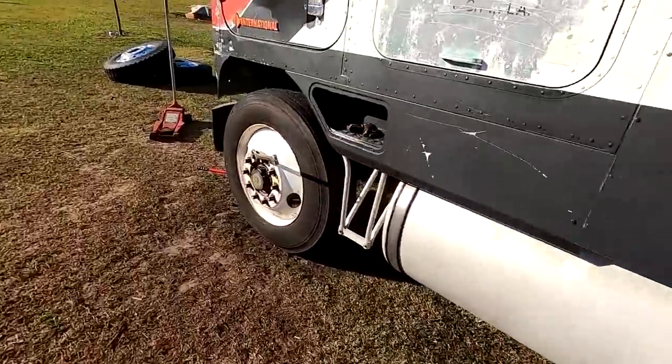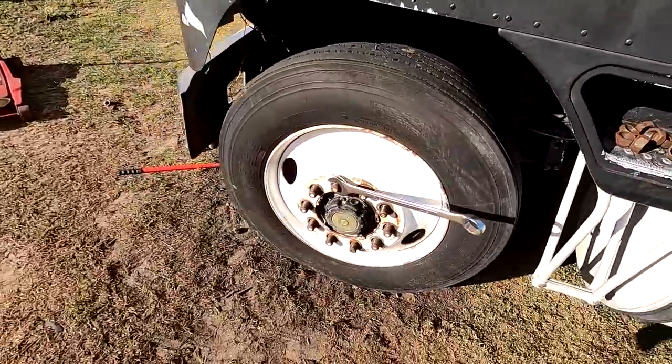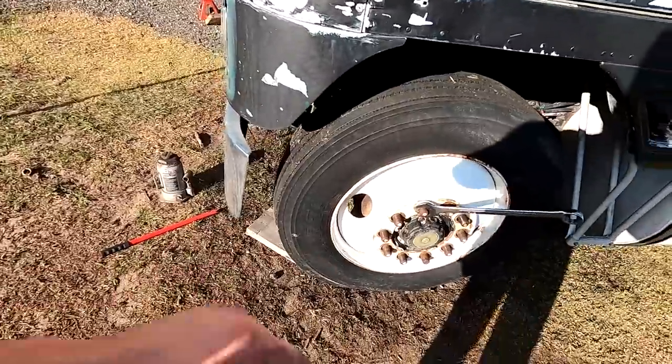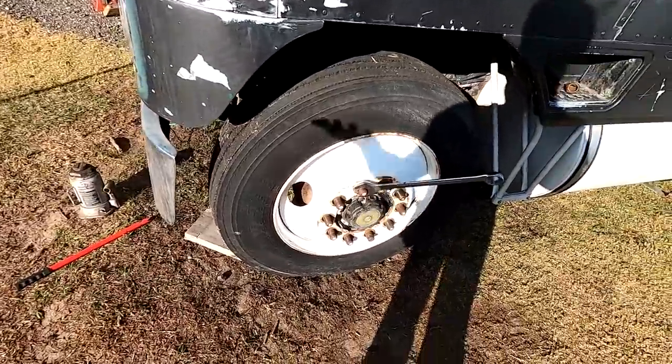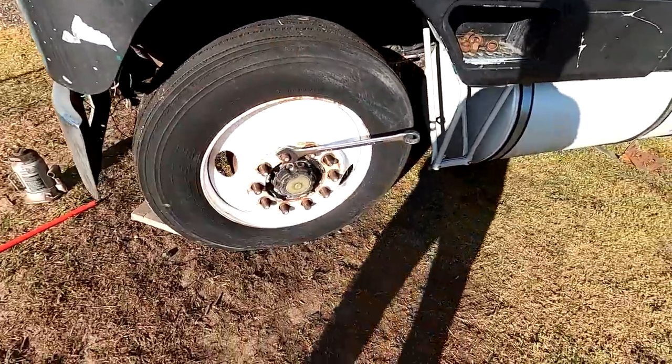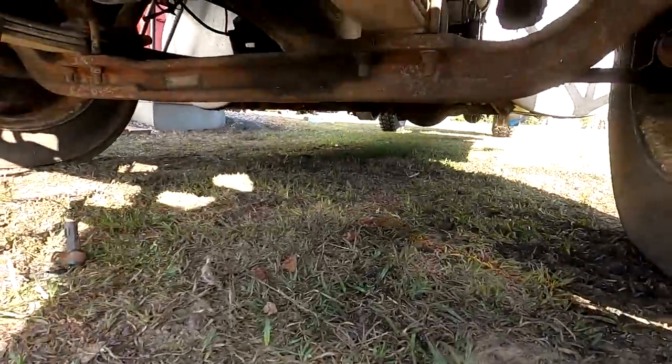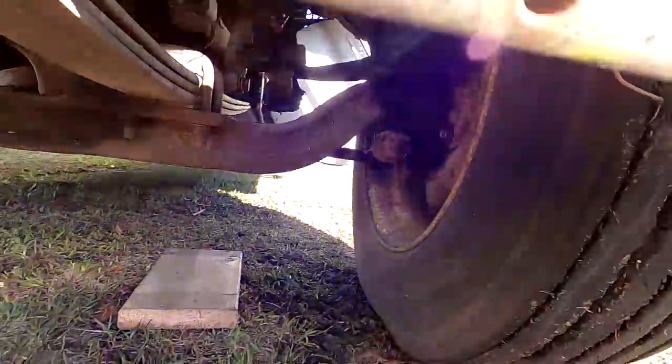But my brother's on the way with the impact and socket for the front, but we got a wrench pulling the front tires off now. And I got a 20 ton bottle jack, put a piece of wood in the front axle, jack it up, get a couple jack stands put under it and check this side out and go from there. But just gotta get this thing shut under here. Hopefully, I don't split this block of wood in half.